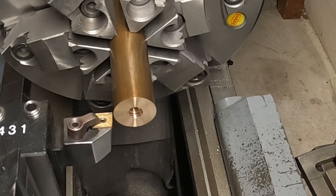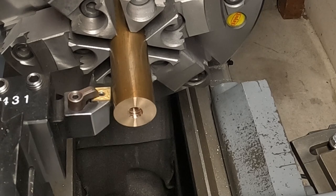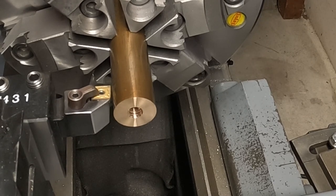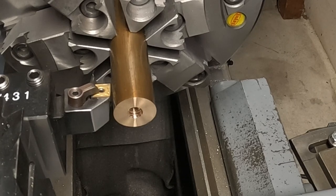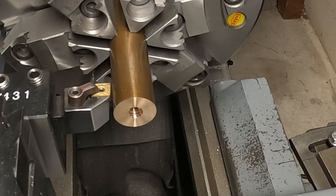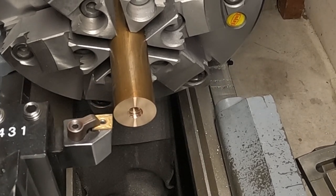Go in. There's one inch. A little bit more. There's an inch and an eighth. That should do it. It will set a zero, or my stop will set here. There we go. Back a little bit. All right. Let's do a touch off here and see how much we got to take off to get it to just a little bit over an inch maybe.